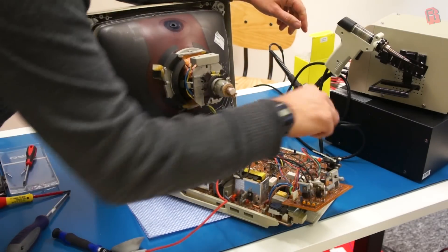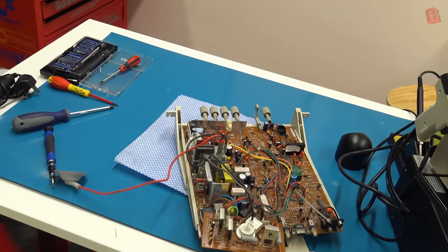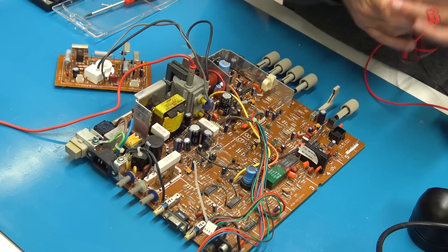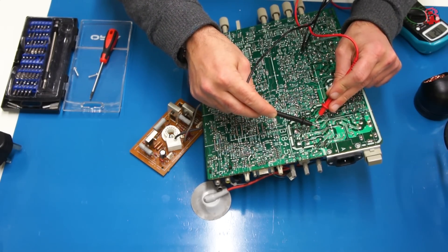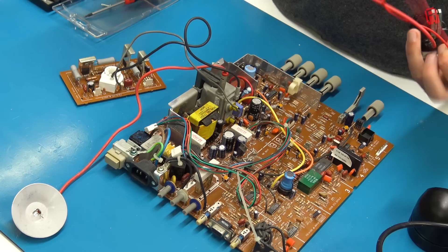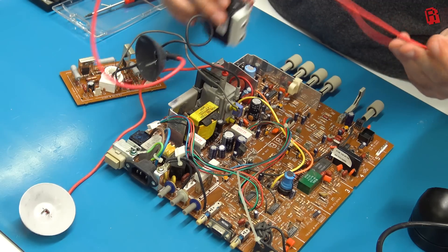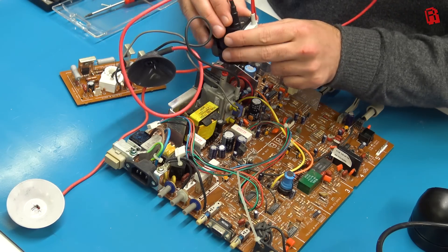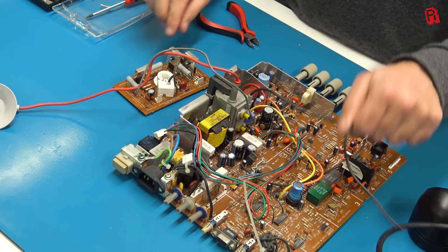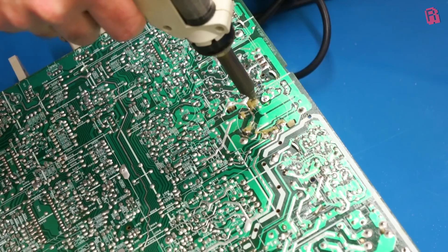Our main board is now free of the CRT and we'll move that out of the way. We've disassembled the monitor and now want to swap out the flyback transformer. Safety first — I did a quick check on the larger capacitors on the board with the multimeter and there was nothing more than a very small charge that wasn't going to hurt anyone. Here's our replacement flyback transformer, which comes with its own anode cap and looks to be the correct part — I'll put the part number in the video description. There are also two very heavily insulated wires going off to the neck board. To make life easier, I just cut these to get the neck board out of the way while we desolder the flyback transformer using big old dollops of flux paste. That helps to get the solder working with the vacuum desoldering gun, and our solder turned molten and came away very obligingly.